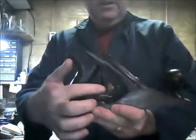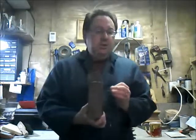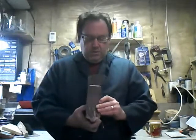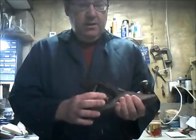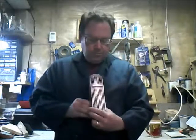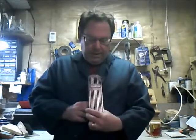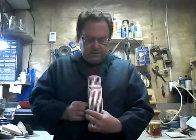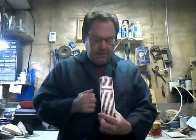I'm just going to make that quick adjustment, and once you get that adjusted, you're going to turn your adjusting nut in the opposite direction from the first time to bring that blade back in. It's going to get really loose, but then it will tighten up — keep going. Trust me, you're not going to break these things; they're pretty indestructible. When I turn it clockwise, I'm going to bring that blade back in, and that is sticking out about the thickness of a piece of paper. If you're ever touching the bottom, you'll always work from the heel to the toe because of the angle of the blade — you don't want to cut your finger.